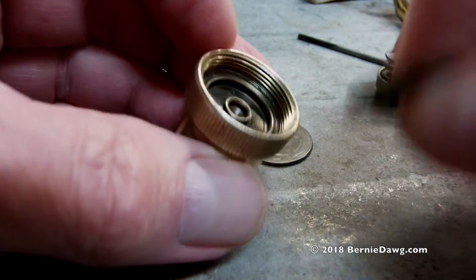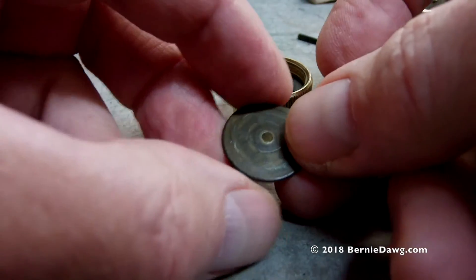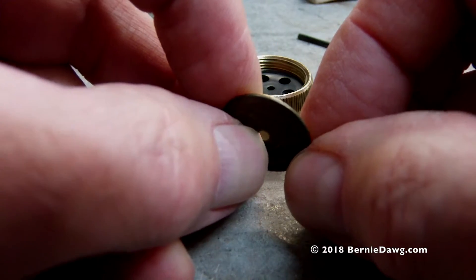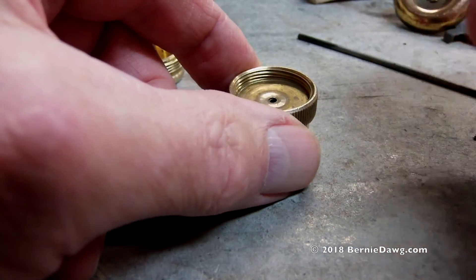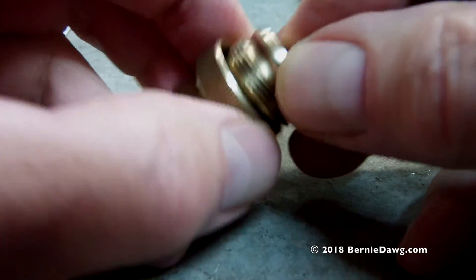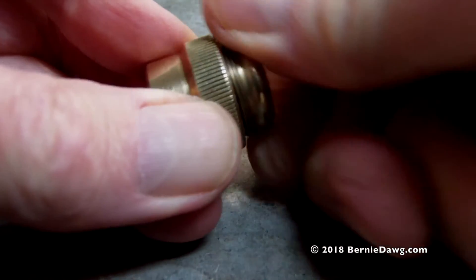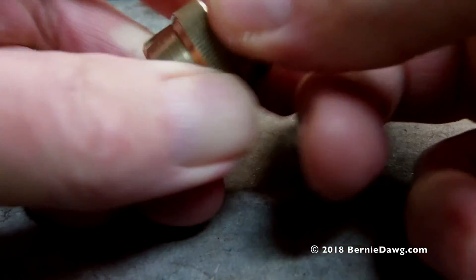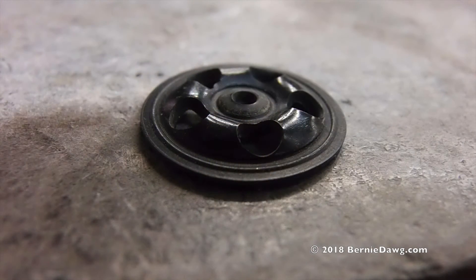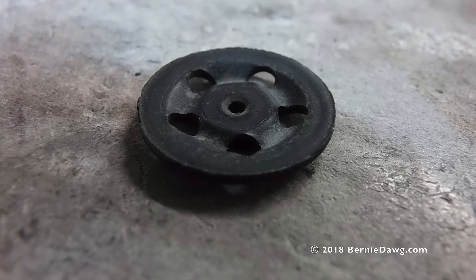I believe that the ease with which these caps can be assembled and disassembled by hand without special tools indicates that they were meant to be inspected and refurbished on a regular basis. The brass disc is kept under stress by the piston, which is going to likely cause fractures over time. And as we know, that rubber gasket is kept in contact with fuel almost all the time, so it's going to deform and expand as rubber gaskets of that era did. Gaskets that look deformed are not something to try to emulate — the rubber gaskets should be flat. I'll show you how to make both the rubber gaskets and the brass gaskets in your own shop in the next video. Stay tuned.